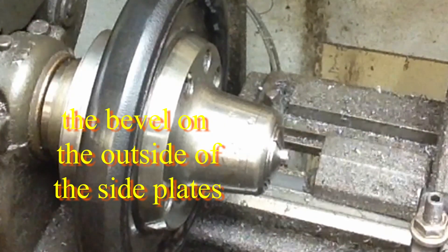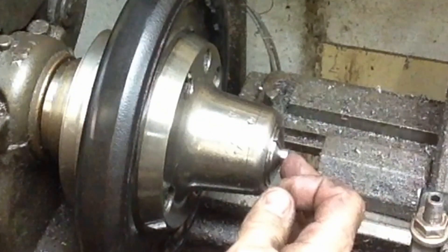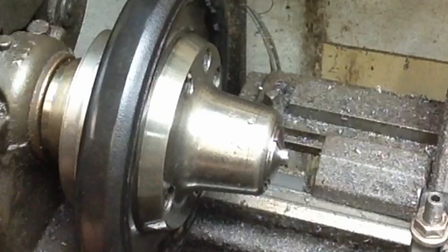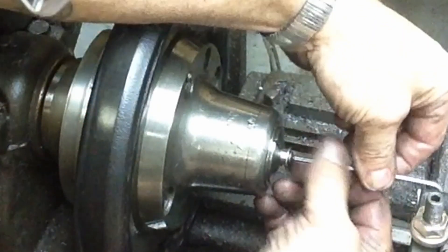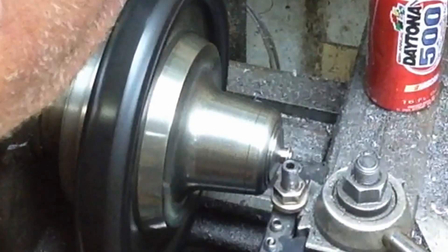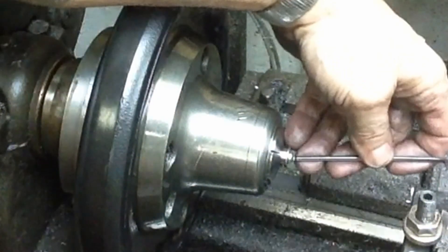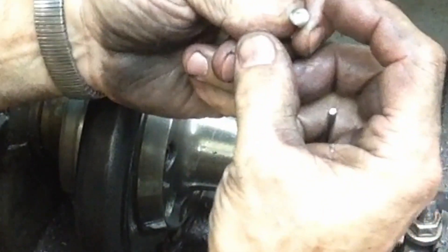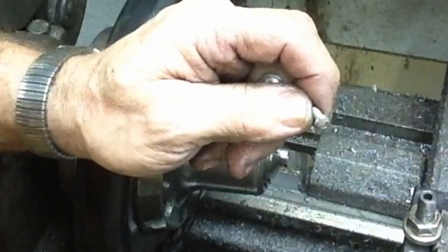What I'm doing is to match the bevel, I'm narrowing down the heads on these little button heads. This is one of the spacers that I've been turning. I left it in there without moving it so it stays concentric. I just take and set our screw through a flat washer to act as a little spacer, threading it in there and using this one little spacer as a mandrel. I've already got my depth set so they're all exactly the same, and all we have to do is a quick little run across them. We've converted our heads down so they're not quite as big around. I'll hit them on the buffer very lightly just to knock any rough edges off. That's all there is to making them a little more user friendly.